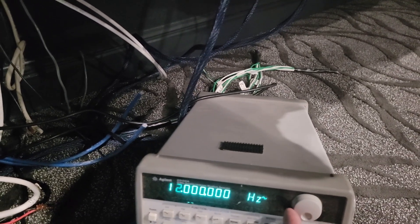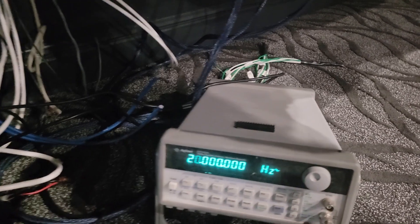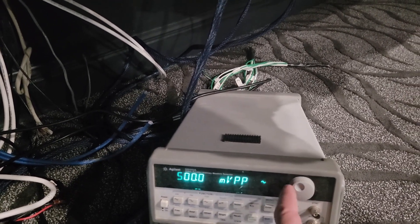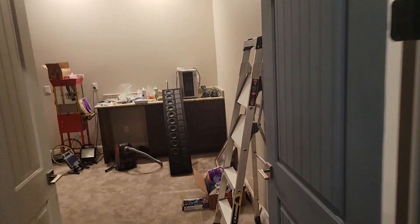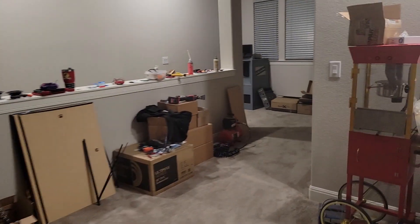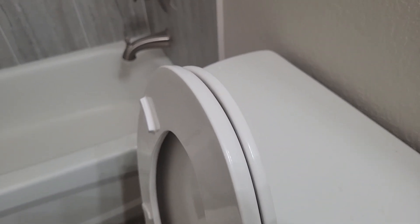You can probably hear that — that's all the loose lumber laying up there. That's 14 hertz, 13 hertz. You can still kind of hear them in there. At 15 it kind of goes away. Bring that up to 20 hertz and let's bring the amplitude up a little more. We're driving that with one volt peak-to-peak. There are a lot of things in here that need to be de-rattled. Out here in the theater lobby everything's rattling — one of the side speakers, and the toilet seat is going at it too. It's definitely moving.